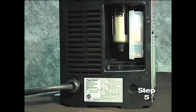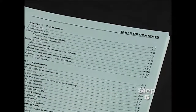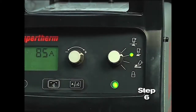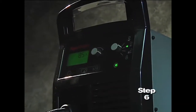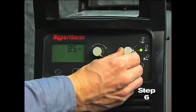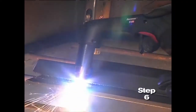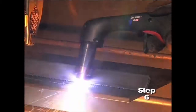For input voltage requirements, the data plate on the back of the system or operator manual has more information. Sixth, set the mode switch to the second setting for plate cutting. The PowerMax 65 and 85 models are designed to sense the incoming air pressure, torch type, torch lead length, and mode of operation and then automatically adjust the air pressure. This feature, which we refer to as SmartSense technology, ensures that the system is getting optimal air flow.